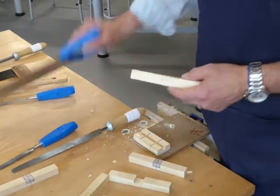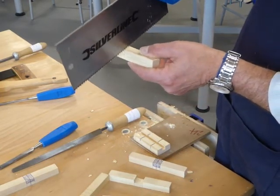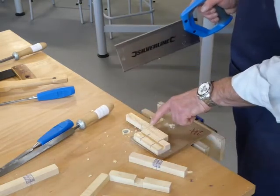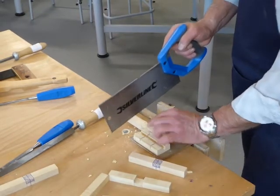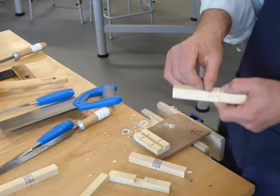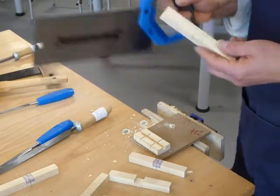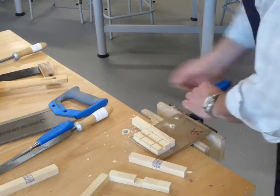How did we start? We start the tenon saw at an angle, and as we get the groove, you start to lower the blade of the tenon saw. You obviously have it on the bench hook. Align this line with the side of the bench hook. Turn the timber around. Align this with the bench hook. Once you have these two lines, I trace three more lines. One, two, three. I'm going to make three slots with the tenon saw, making sure I'm looking and stop in the right place. This will be easier for us to use the chisel.